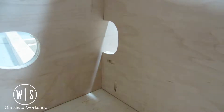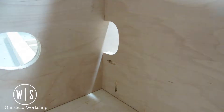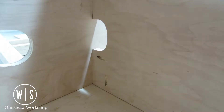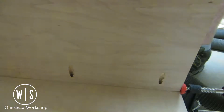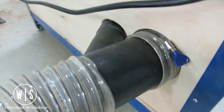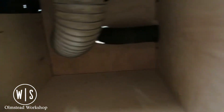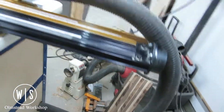Here you can see where I cut some reliefs in the center panel as well as a hole in the back panel to route some dust collection hoses. My dust collection enters the table with a Y, with the four-inch side going up to an Incra clean sweep dust collector and a two-and-a-quarter-inch hose that runs through the back side of the cabinet up to the Incra fence.